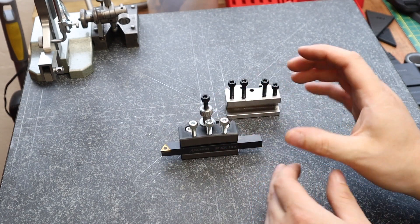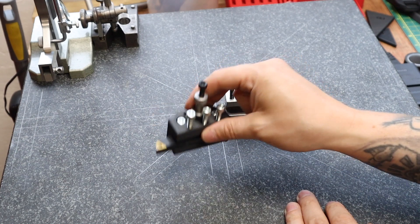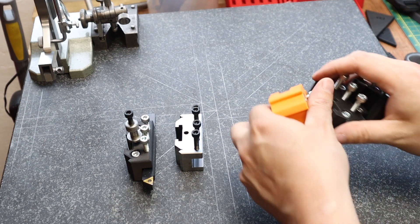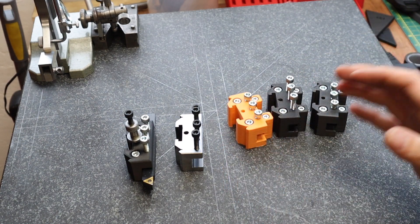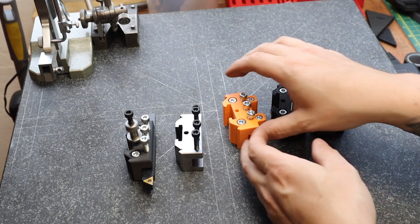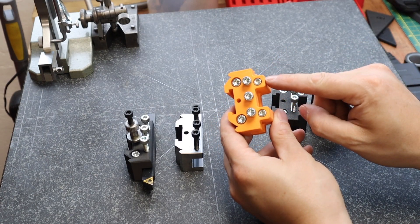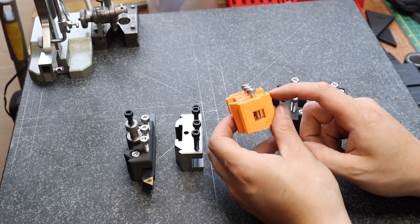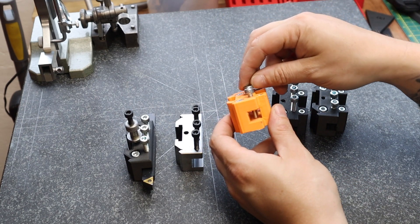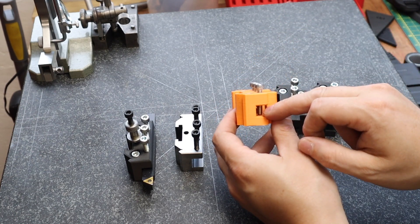Off camera, I've jumped back into CAD and made some design changes to this tool holder. We now have three newly designed tool holders to test to destruction. The main change I've made is adding this front portion, sandwiched together with some M4 cap screws. I'm hoping that when I slide my tool in and clamp it down, it's not going to splay that front bit open, and will allow equal pressure onto the tool.